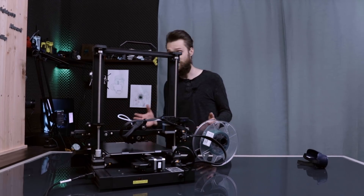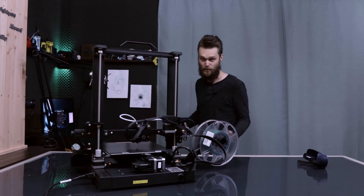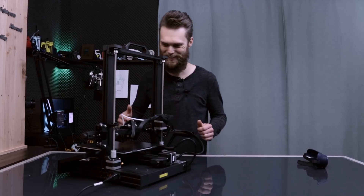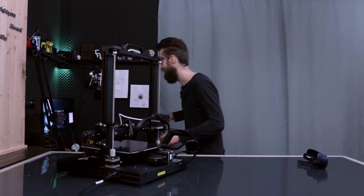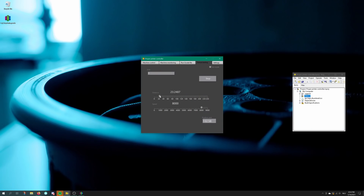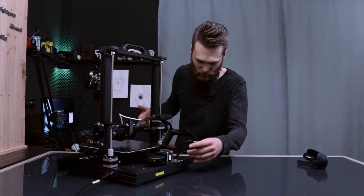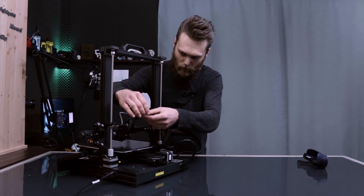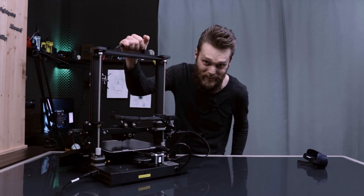I've got a torture test — I can select which axis I want to use, hit Start, and the first thing it will do is home, which is pretty important to do first. But that's done automatically, and once it has homed it will go back and forth. We can do this faster, more violent. I'll do the Y axis. At lower distances we can find the resonance frequencies. You can use this to check how the wiring will perform with these movements, and I can already see that these clips won't hold when you do a torture test on the X-axis.